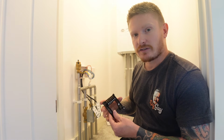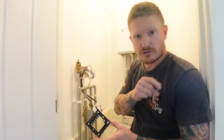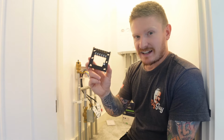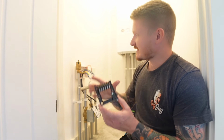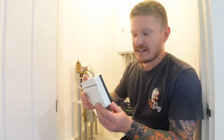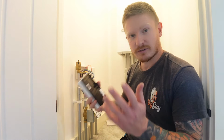You might find yourself in a situation where you've got a programmer, a digital programmer, a bit like what we now saw on the walls. You might have one of them near your wiring center. You might be able to pop that off, and you might find one of these underneath because this is industry standard. There's a lot of situations where your existing system will already have one of these in place. And if that is the case, you'll have no wiring changes to make. You'll be able to pop your hub straight on, you'll be able to clip it on, and you'll be able to avoid doing any wiring at all.